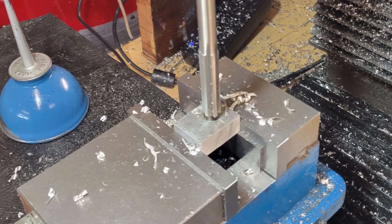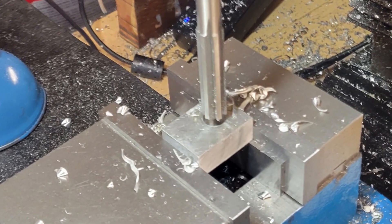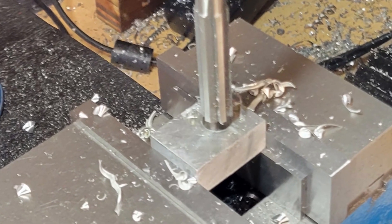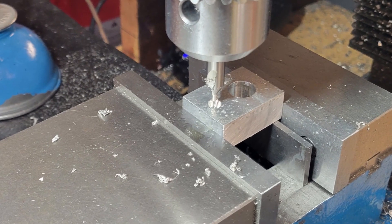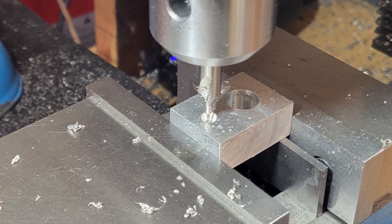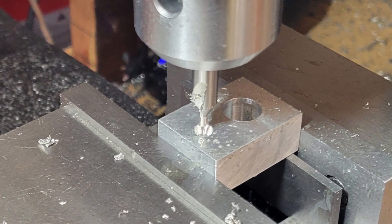When I made the ends of the camshaft fixture, the important dimension is the distance between the center of the camshaft and the centerline of the lathe. I drill and ream the 1/2 inch hole that will hold the camshaft split washer, then center drill the hole used to turn the fixture on centers in the lathe. The distance between these two holes determines the flank radius of our camshaft — you can look at the second page of the camshaft drawing where this term is defined.